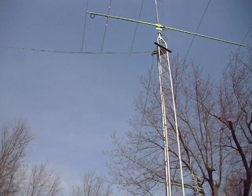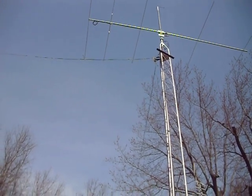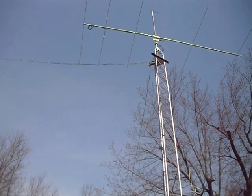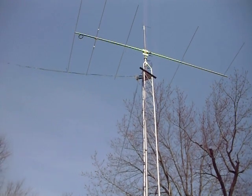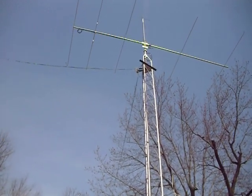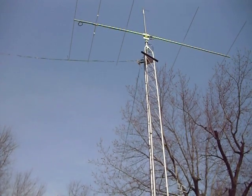I just wanted to show you that antenna — 251 feet of wire in a great big loop. The center of the coax goes to one side of the loop and the shield goes to the other. I used the aluminum shield RG-11 quad shield coax. I used that little six-inch square Lexan plastic sheet up there, put two stainless steel nuts and bolts through it, and fastened it to the coax that way — because you can't solder to the shield, which is aluminum. And boy does it work nice.